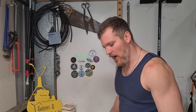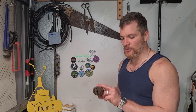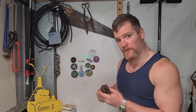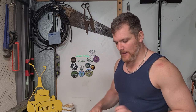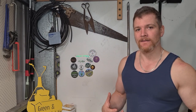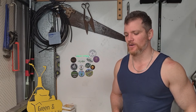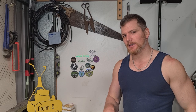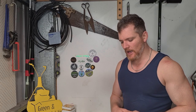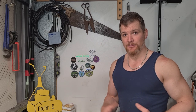And I will be drilling the hole a little bit smaller, because there's too much play in this. I might shoot for maybe 10 mil, because if we've got too much play in our front roller, what we can experience is a chattering in our cut, and you'll notice some waves and stuff. So I just want to tighten that up a little bit, because this was softwood. I think it just bore it out a little bit, whereas this is going to be hardwood, so it's going to hold up to that abuse a little bit more.